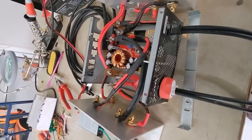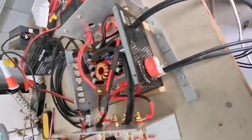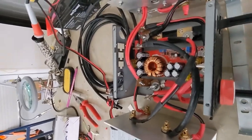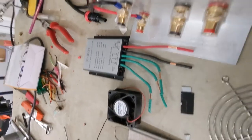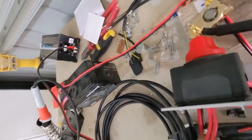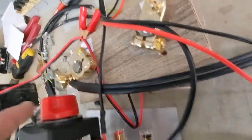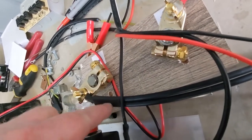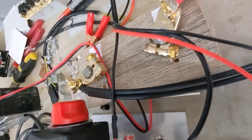The key problem is that those grid tie inverters want 300 plus volts to get optimum. They'll work at a minimum — some of them down to 65 volts, others with a minimum of around 80. So this device's job is to accept charge from the wind controller, store that in some kind of battery. At the moment on the prototype we've got a 9 amp hour AGM. We start to ramp up our leads from here — we've got dual 12 gauge wire, which brings us down to about 9 gauge US standard, around 4 to 6 millimetres paired. That should get us around the 40 amp limit.